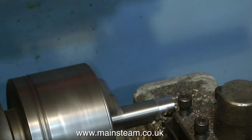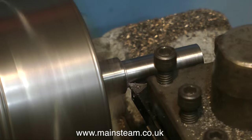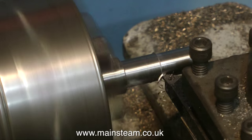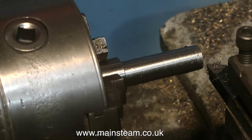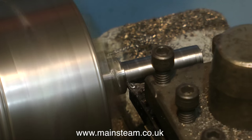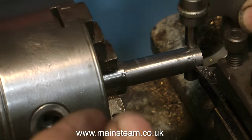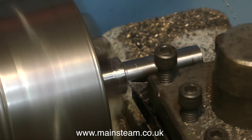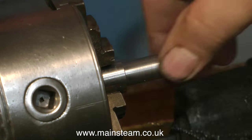I'm purposely taking fine cuts here — I don't want to overstress this part at all. Here I'm speeding up the video because it is a long job; it took quite a while, and I don't want the part moving or jumping out of the chuck. You can see me going back and forth, applying some 3-in-1 oil as a lubricant, and frequently checking with the micrometer. When I get near to the finish size, I try the end part before taking the main cut. This end part is going to be cut off because the whole thing is slightly too long, so you can do a quick test with your micrometer before taking the final committed cut and going all the way down.